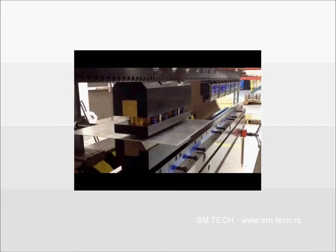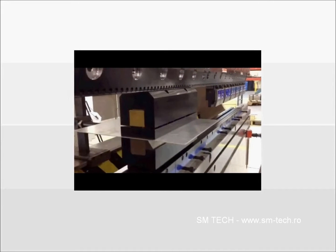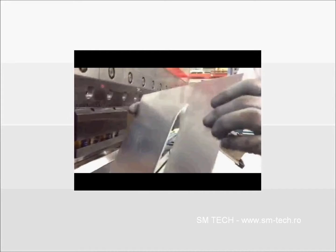And like I say, what you're going to see here is just a blank sheet. We didn't show that to you ahead of time or anything, but it's going to pierce the material, and it's also going to form it. Nice, big, tall louver. This is a good press brake application. You wouldn't be able to do this in most punch presses, I don't think. And now what you're going to see is the second louver being put in, so we can gang louvers up as well.